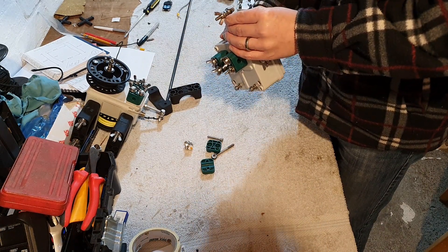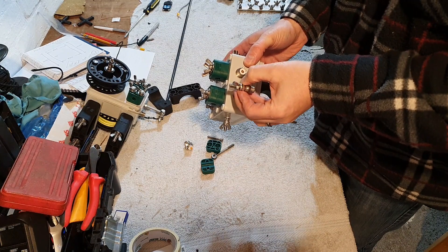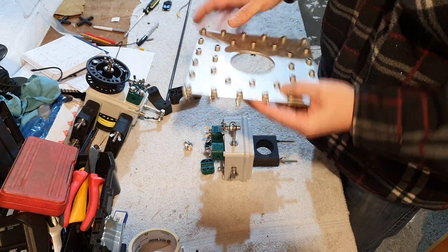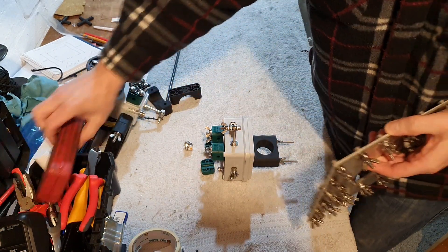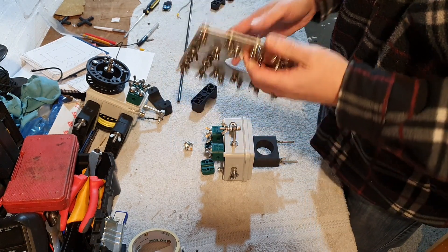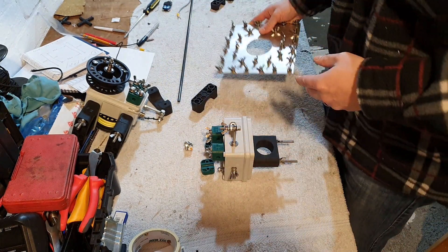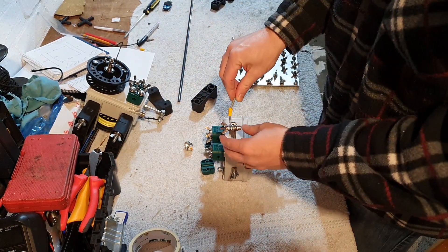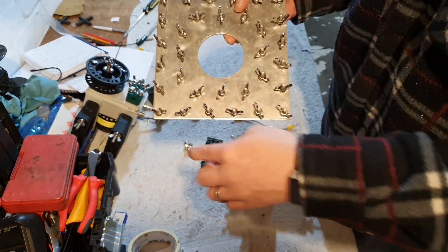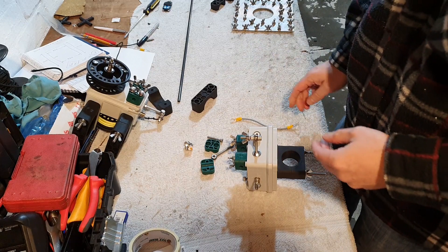Regarding the radials: if you have this elevated you could just have tuned radials — perhaps five wires connected here. But what I tend to do is use a radial plate. This is a homebrew radial plate; I bought this plate from eBay. I think it's about 4mm thick, and I made up a template, drilled all the holes, and put in all the stainless steel fixings. I've got a little tail so I just connect onto here, screw it onto the plate, then connect my radial wires around it. It works a treat — I've got two of these, you've probably seen them in the other videos.